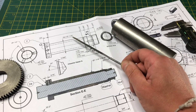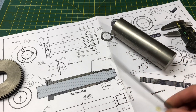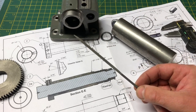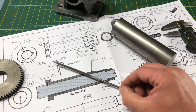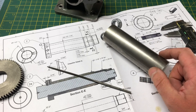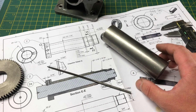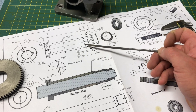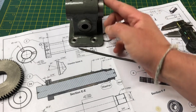The external diameter of the spindle is dimensioned at 1 and 1/16th nominal, but it needs to be made to fit the bore machined in the casting. Mine is 1.065. The internal bore is at 3 quarters of an inch, and this will be drilled, bored, and then reamed to final size. This bore will then be held on a mandrel to ensure the concentricity of all of the other features.